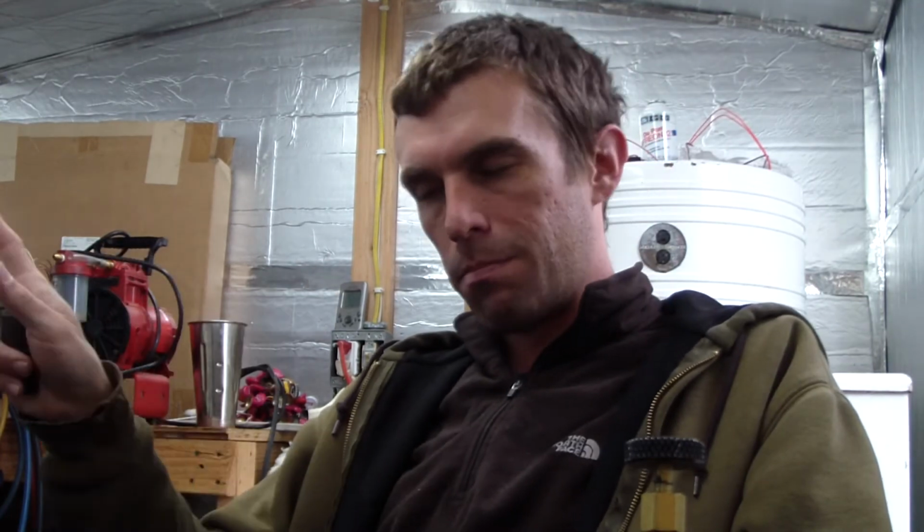The plate, the heater. To me, that means that as long as you're controlling the amount of leakage around, and we thoroughly insulated around the heater and the evaporator, essentially all of the heat being put into the evaporator is coming out of the condenser. So we have that 200 watts, heated up by 15 degrees. We more or less know the latent heat capacity of the alcohol. The sensible heat, as far as any temperature changes in the alcohol, is pretty negligible for this application, so we focus on the latent heat. We should be able to calculate roughly what the mass flow of the alcohol is through there.